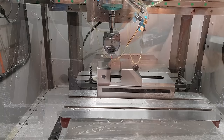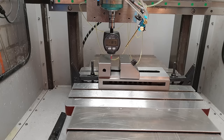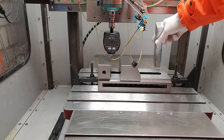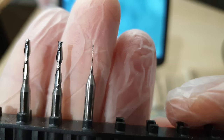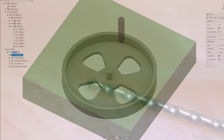Let's make one more aluminium part but microscopic this time — with microscopic tools, high RPMs, and high-tech optimal-load toolpaths. I have no experience with this whatsoever, so there will be some microscopic casualties I'm afraid. I want to try using solid tungsten carbide PCB bits — they may not have the perfect geometry for metalworking, but they are cheap in large quantities and break easily when something goes wrong, so my lack of experience doesn't pose a threat to the fancy spindle.